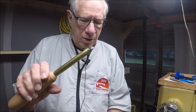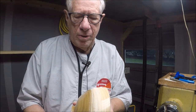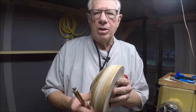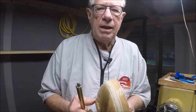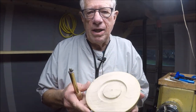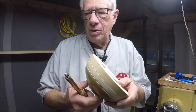This is the elf tool — you can see it spins inside a little case and makes a neat little groove. I also used a three-sided pointing tool to make grooves in the surface. That one is waiting to have the black applied. I can't put the black on today because the humidity is too high here in South Carolina — 80 percent. I need it below 60. I like to do the outside all the way to finish, then come back and do the inside, so I have the tenons available on both sides for the lathe.